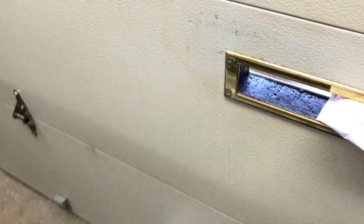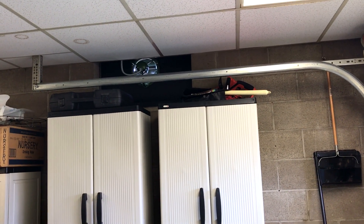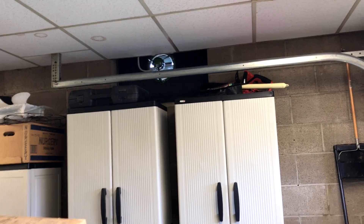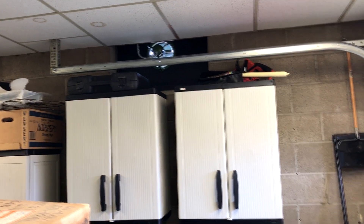Someone's going to ask why we don't put a makeup air vent in — no, that's not the purpose. The whole purpose is we're going to be running it during the summer and winter when we don't want to suck in outside air. We're using it kind of like a bath fan — negative pressure in here so fumes or anything don't get into the house. Solder fumes, whatever we may be doing when we don't want to have this door open in the dead of winter when it's 10 degrees, or in the summer when it's 90 degrees with 100% humidity and we have it climate controlled.